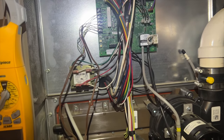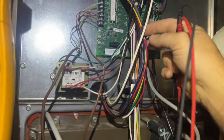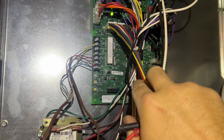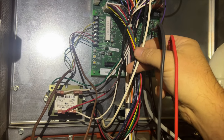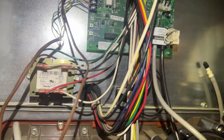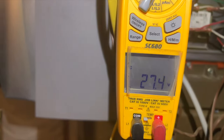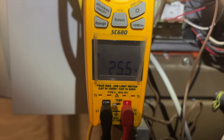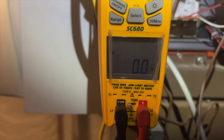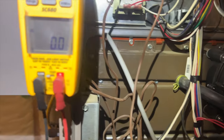We're going to see what's up with this blower motor. This blower motor is a constant airflow ECM, so we have our communication wiring here — this tells it what to do. These other wires are the high voltage, which is applied all the time even when there's no call. First things first, we want to make sure there is no call for anything. We have a call for fan — 24 volts. Heating: nothing. Cooling: nothing. So we're receiving a call for fan and it's definitely not running.